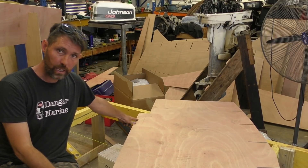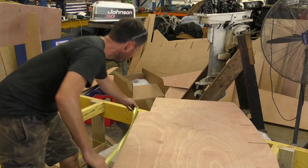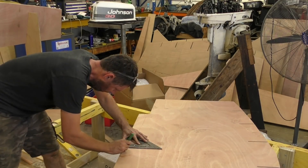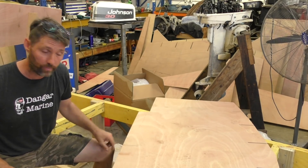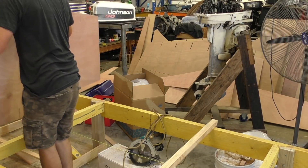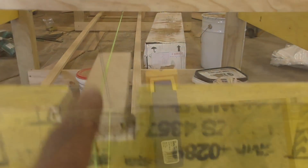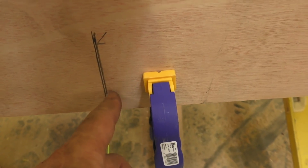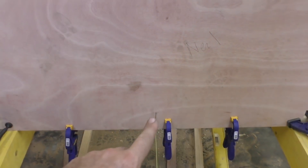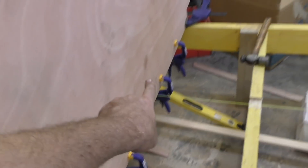I'm going to take one of my 2x2s and put it on the inside of that line towards the back of the boat, as per the plan. Another thing we have to have is a centre line marked on our bulkhead. So I'm going to measure both the total width and the width in here, see if they agree with each other, see how they line up to the peak, and then mark that on. We're going to now put it in place and clamp it on, then I might just need to shuffle it until this centre line is directly above the string line. I've temporarily blocked this string line up a little bit so that it doesn't contact any of the other timbers. We can see that this is actually a little bit off to the right, so I need to tap this bulkhead a bit to the left before I screw it in place. Neil's looking pretty happy in his new home now — centred, and then clamped onto this bit of 2x2 going across. So now I'm going to put some screws — a little bit temporary — through the ply into the 2x2.